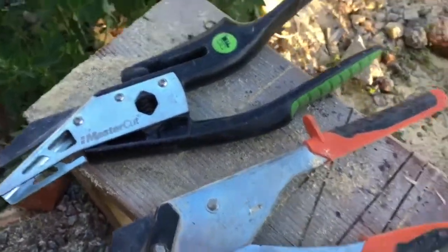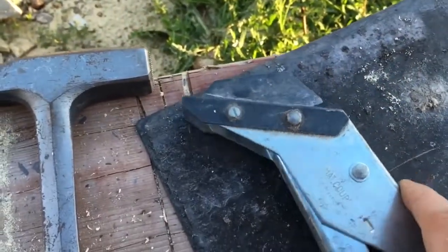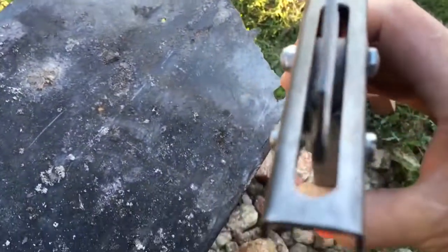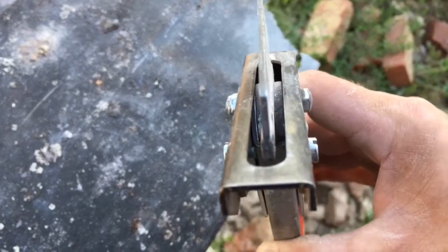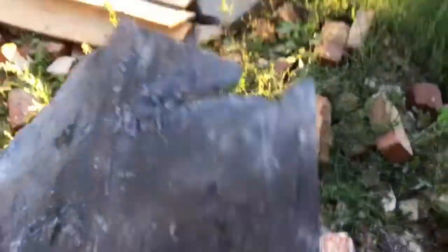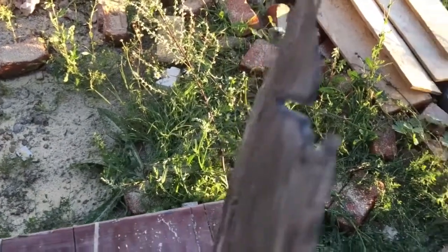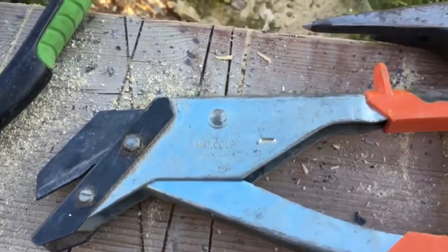Number three is this green one - not the orange one, because I already had the orange one. These are slate cutters, some sort of hardened steel. You notice it leaves quite a big gap between where it cuts - there's no tight sides - and that allows, if you cut from the back, you get those bevel edges. They still look a bit straight so you try not to put them near the edge, but it looks better than just a grind cut.